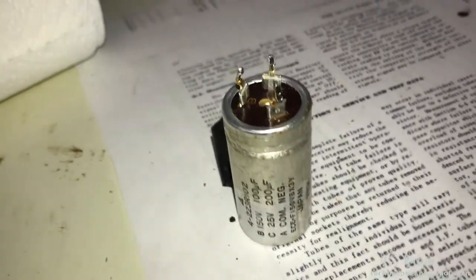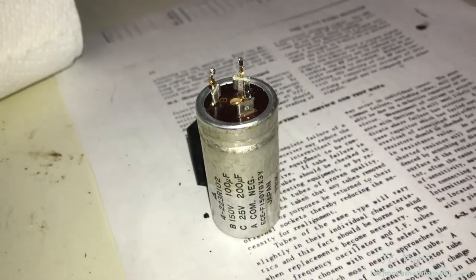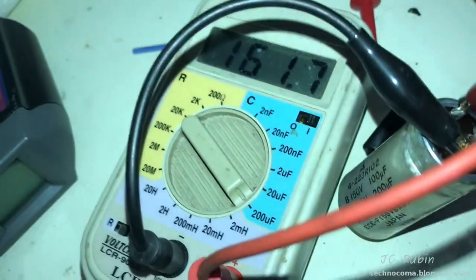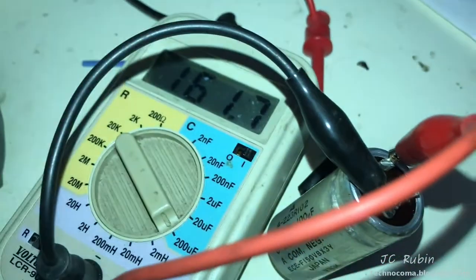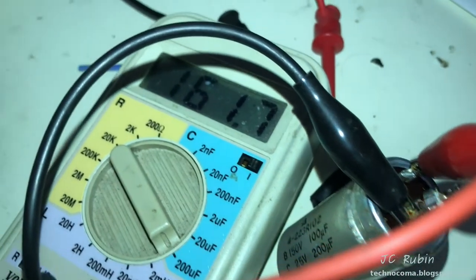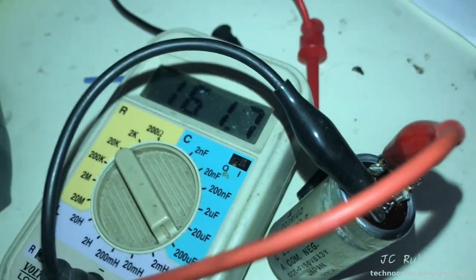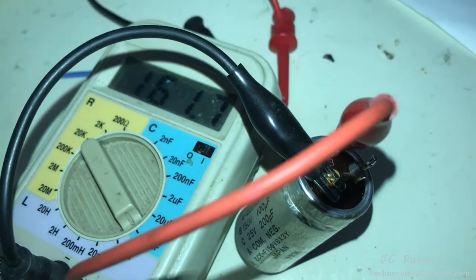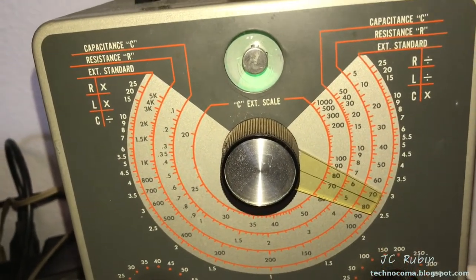I've decided to pull out that electrolytic capacitor, looking at the excessive current draw, and see what's going on. It was an easy pull, so I did it. Going to hook it up to the IT11. I can't read AC, because AC, being 200 microfarads, is technically off the charts, but looking at AB, B is showing 161 microfarads, where it's supposed to be 100. That doesn't instill any confidence. I don't believe I'm going to have any more success reading it on this machine. Its limitations also start to taper off around 50.